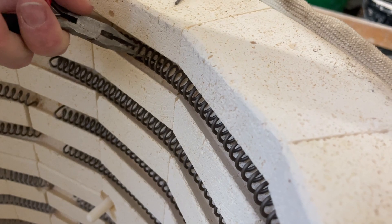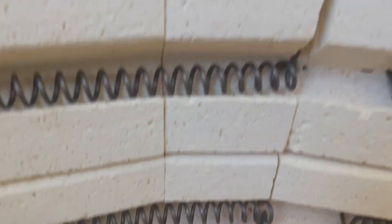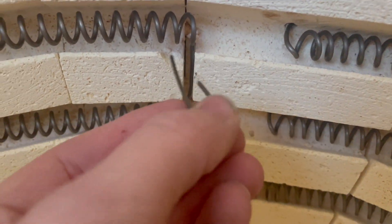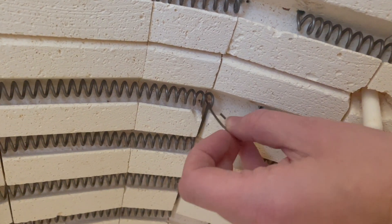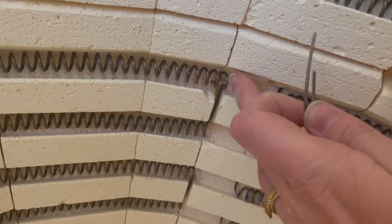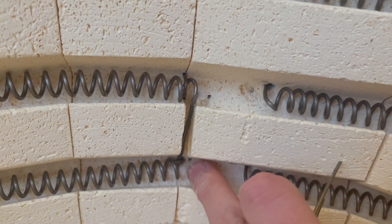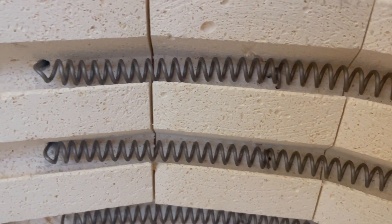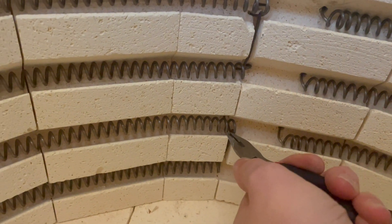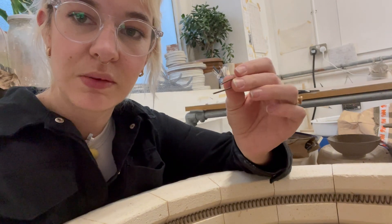Now the elements are nicely fed in and housed in their little spot. I'm going to get to pinning them in place exactly where they were pinned last time, and Jack is going to be on the other side bending the wires into place the same way as they were. Kiln brick is so soft it's really easy to feed the pins in where they need to go just with your hands. If you can follow the holes where they used to be that's handy, but you don't have to — just go into the back of the coil rather than the front. I push all the pins in first with just my fingers and then go around all of them with the needle nose pliers and really press them in.